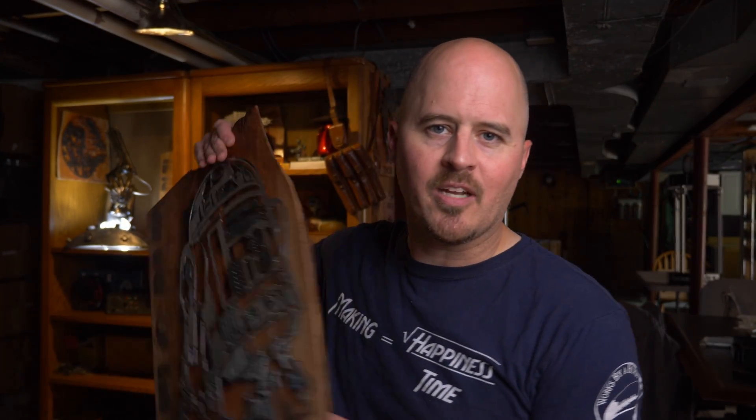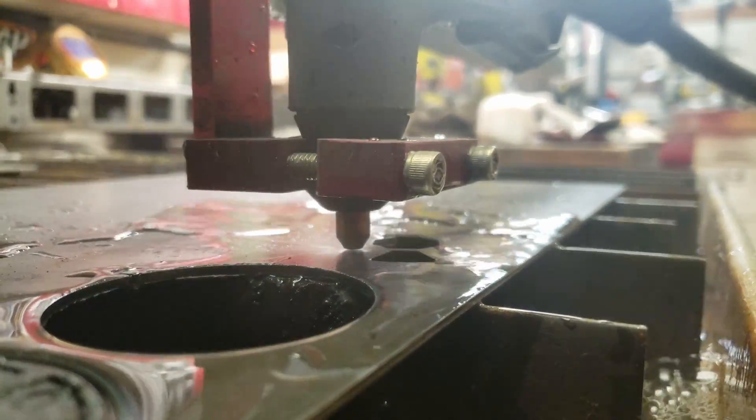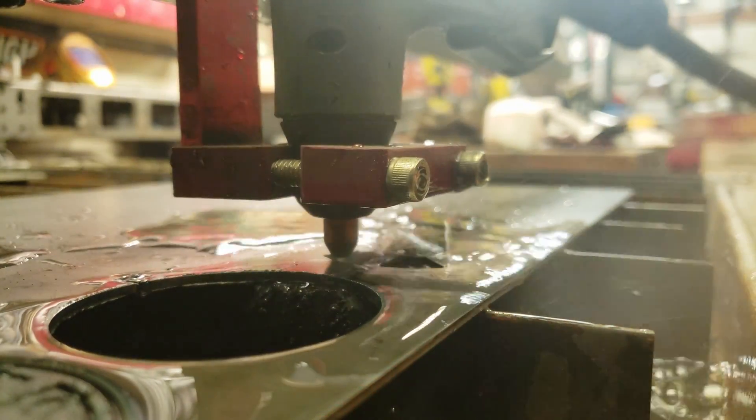That's happened a few times for me as well. On a piece like this, the cut time is about 20 minutes and I'm there the whole time holding the sheet metal down and watching for tip-ups. You can't leave it alone — that's the price you pay. I'm sure that if it had torch height control it would pick up the torch between cuts and that might be eliminated to some degree. Then there is the water table. I opted for it, and some of these really small, fine cuts like on the R2-D2 would not be possible without it, because the water splashes up and cools those fine pieces so they don't completely melt. It also keeps your workpiece from warping. I think it is very valuable to have a water table.